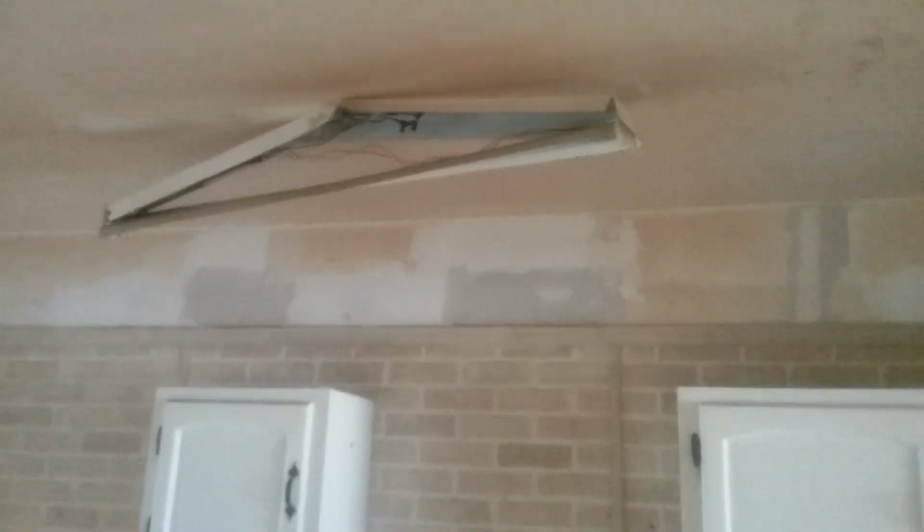make sure you got that out now. I'm going to go turn the breaker off. Now come back and we'll get to this. Okay, I went out. I've turned the breaker off. And there again, just because it says kitchen light, well actually the breaker to this one says sub panel. So you cannot trust a circuit label. Always test it. There we go. Dead.